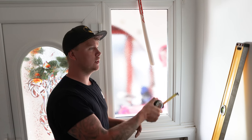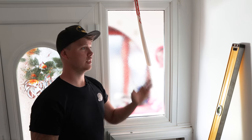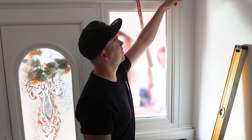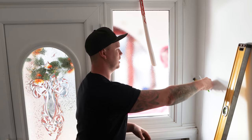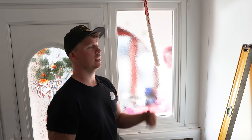So first things first for me, boards here, we don't have access anywhere to get upstairs through the wall, through the cavity. The old ones are here and they're clipped up to the top. A few of the other ones are actually pushed into the porch and clipped directly on the surface. We're gonna bury them. We're gonna use the regs of 150 mil from a corner, chase up. We'll be bringing power to the loft on its own. We've got upstairs sockets, we've got downstairs lights, we've got upstairs lights. So there's our four circuits.